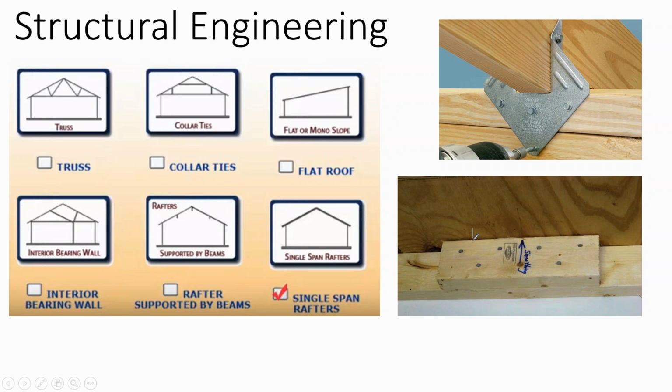When you put a lag screw into a 2x4, that metal is stronger than the wood. If you're on center, and not nicking the edge, you're going to get good pull strength and you're not going to weaken the rafter. What happens is when you remove the lag screw, let's say you're replacing the roof or the solar array, it's going to leave behind a pretty sizable hole. These lag screws are like 3/8 or 1/4 of an inch thick, and that hole can weaken the rafter, so you have to fill it in with structural glue.